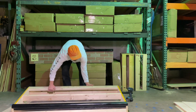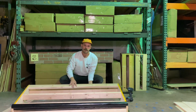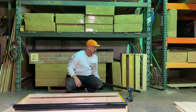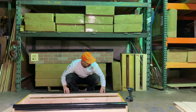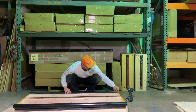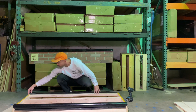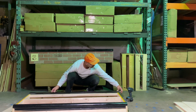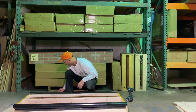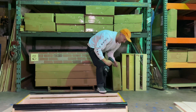All of my ribs are in place, attached from both ends with the two-and-a-half-inch screws. My coping is in place, and next I'm going to attach my one-by-two rectangular coping. There are some nice little grooves that it just sits right into. Make sure that it's tight and that you have a similar reveal on both sides — about a sixteenth on each side. I'm going to go ahead and use three more of those two-and-a-half-inch screws and sink it down into this two-by-four.